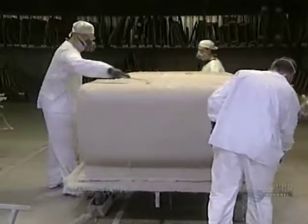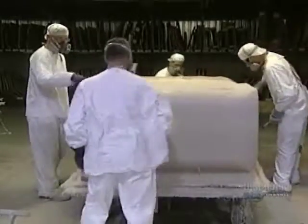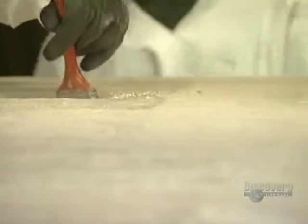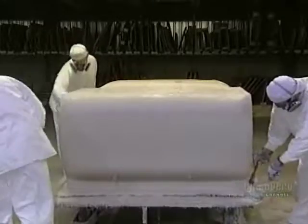Laminating is one of the most important steps. With brush and roller, they eliminate all air bubbles, which could weaken the tub. This makes the fiberglass resin adhere perfectly to the acrylic shell. The process requires 75 minutes.